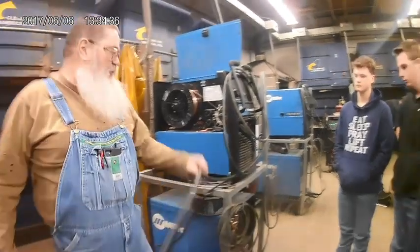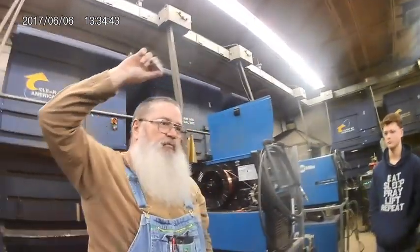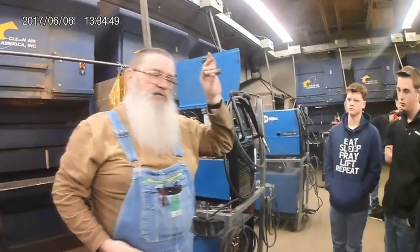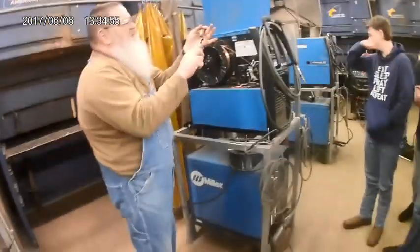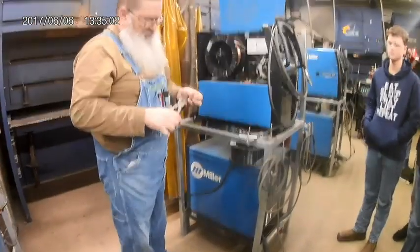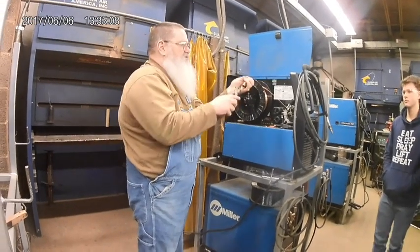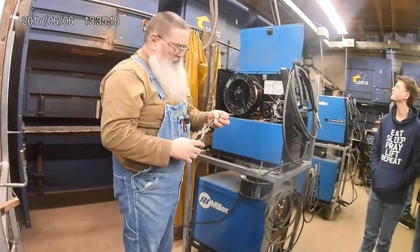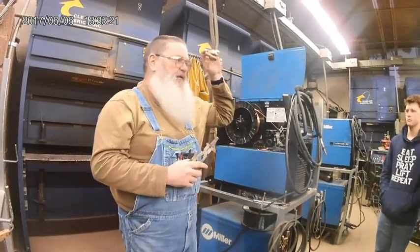The other thing that the pliers is for is for cleaning the nozzle. So those little sparks and stuff that come off the process jump up inside here. After they build up too much, they'll make that hole close up. When that hole closes up, the gas can't get through there very easily. So I can take the tip of these pliers, you just notice they're square on the edges, stick them in there. When I take the tip off, kind of go back and forth with it, it will rake some of that stuff out of there. I can grab some of it with the pliers, clean it up. But these, the tapered ends right here, are designed to go in there, kind of ream that back and forth. When you look in the end of your MIG gun and you see a bunch of stuff built up on this, probably time to clean it. Okay.